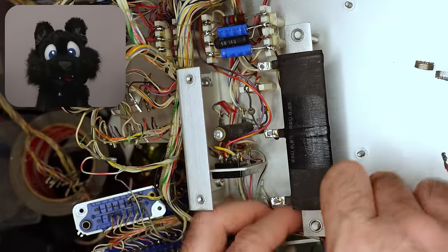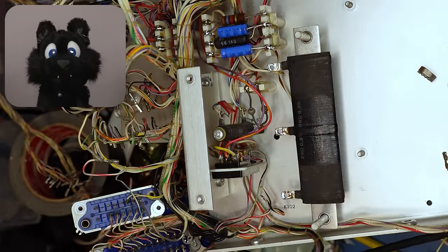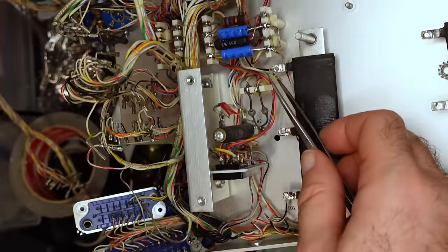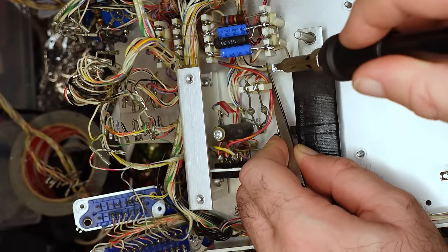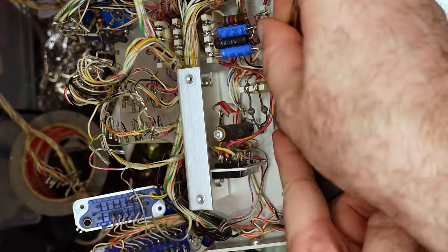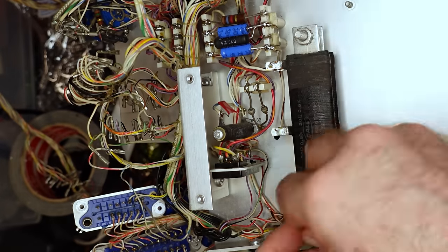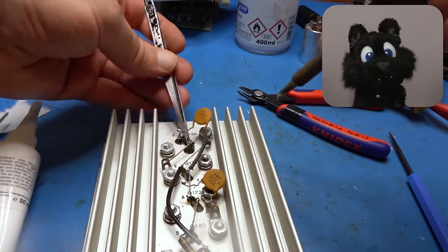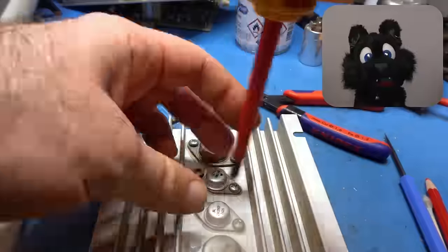The huge power resistors, two doubled up 20 ohms, are part of the current setting network on the step generator output. The little heatsink in the core of the unit is actually the output stage of the step generator amplifier. It deserves new thermal paste.